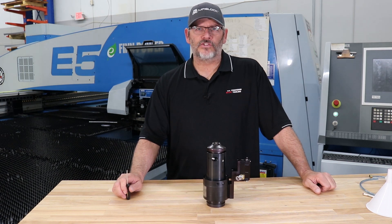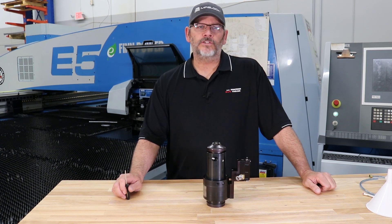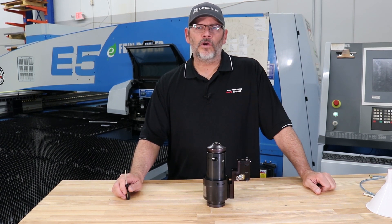The Thick Turret 2 inch tapping unit comes with a specific tap size installed. A number etched on the end of the tap assembly indicates the pitch size. Before installing into the machine, we should confirm the correct tap size is installed.